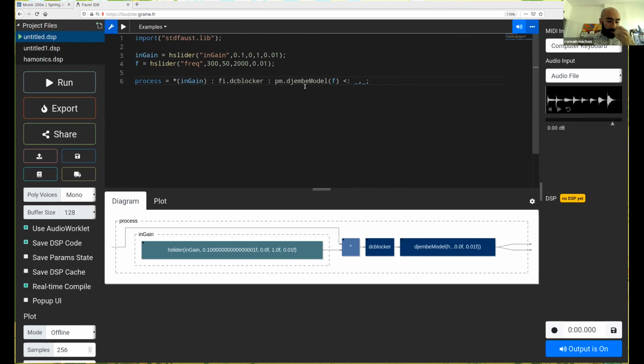Okay, so I think that's something that I'm saying in the assignment, but one thing that is important for this homework too is that piezos are contact microphones, right? And if you want to get a good signal out of the piezo, it's better if the piezo is coupled with the material that you're using as the source. Say you're putting the piezo on a coffee mug, right? If you just tape the piezo to the coffee mug, you're not really going to get a very good coupling between the coffee mug and the piezo.